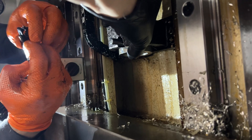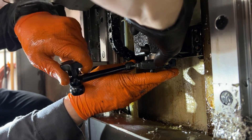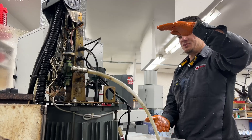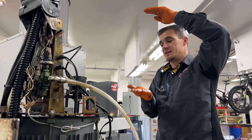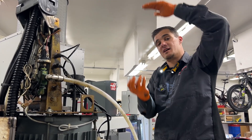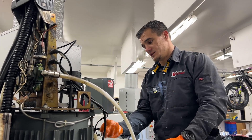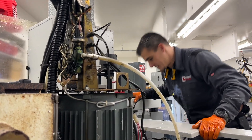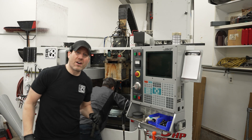Pins are in. So now the jam nut up top here — the jam nut is sucking the whole ball screw up. I've got to make sure the nut on the other side is not pulling the bearing with it. So I'm going to loosen that nut up a little bit more — it feels like it's starting to pull it. You've got to be careful and really attentive to what you're doing.